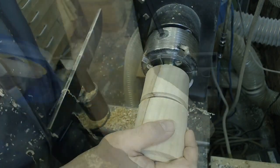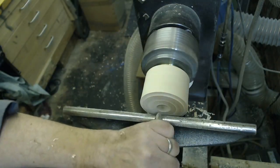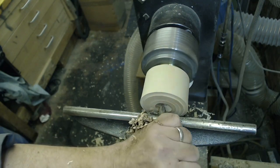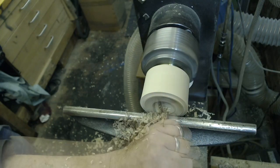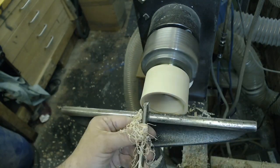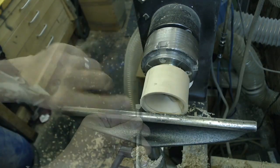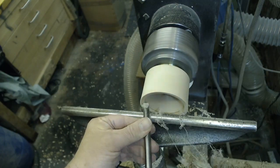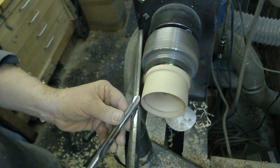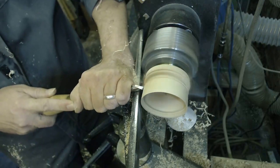I need to separate the two of them permanently, so quick work with a little saw. Here we go making the top — I'm just hollowing out the inside of the lid first using a 3/8 spindle gouge, I think that's 10mm. Just tidying up inside there, putting a little rim on the inside which will sit on top of the lid spigot, and a little undercut before the sanding, just so that it'll meet neatly when it sits on the bottom.